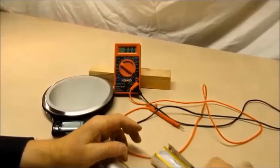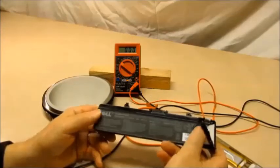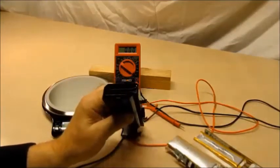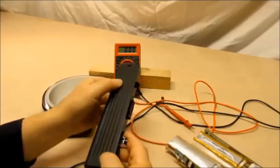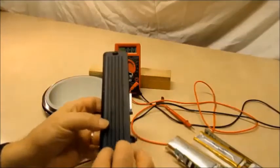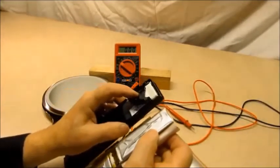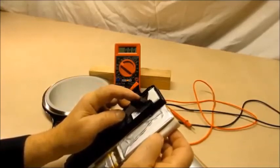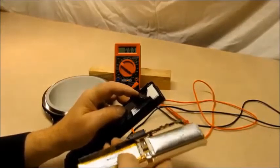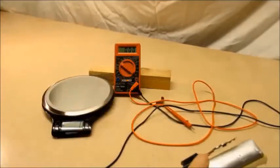I was not expecting this: when you get a Dell laptop battery it looks pretty similar to the 18650s you'll find, but this ridge here is kind of a giveaway — not all of them have that. These Dells all have that ridge, and when you try to pop them open you can see they have the lithium poly cells — the little pouch cells — and you'll notice that little pouch cell is starting to puff up. That's not a good sign. These aren't what I really need for the project, so these have to go back.